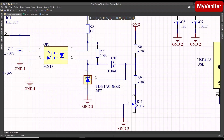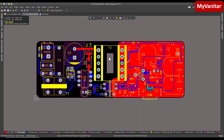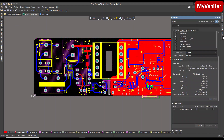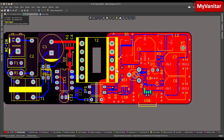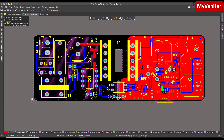Let's go to the PCB. Here is the PCB layout — as you can see, it's a two-layer PCB board and I used a mixture of SMD and through-hole components. The horizontal size is 96 mm and the vertical size is 33 mm. I followed some PCB design rules, the first being these two creepage or isolation gap areas. I had to implement these areas to follow the IPC standard, because the left side contains high voltage and non-isolated ground, while the right side contains low voltage and isolated ground. These creepage areas are quite mandatory, especially the one below the optocoupler.